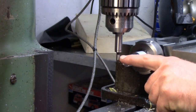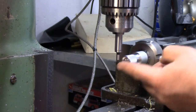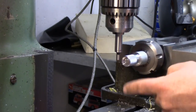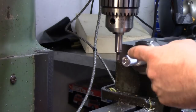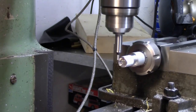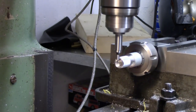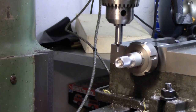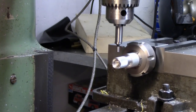touching surface here, which is 200 thousandths. So we're going to come in 100 thousandths. That'll make this spindle directly in line with this edge. And then we're going to track over 300 thousandths. So basically I'm going to touch and move over 400 thousandths. Zeroed my readout, and I'm going to move over 400 thousandths.